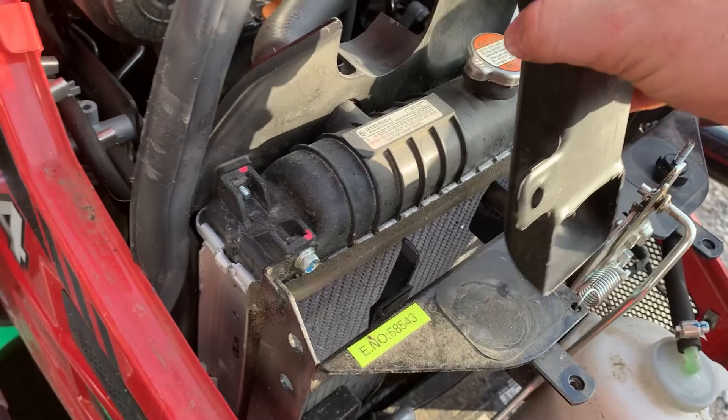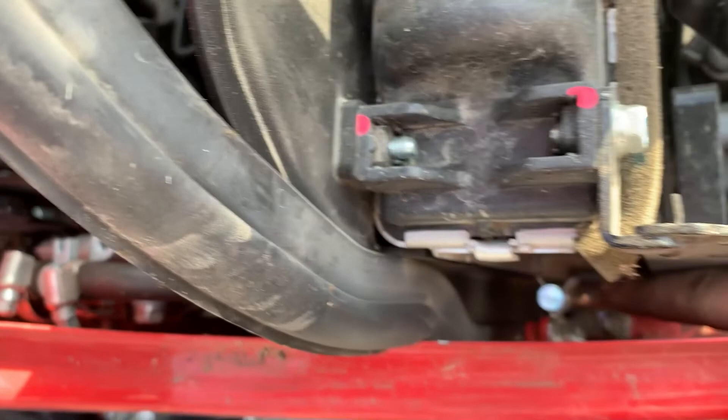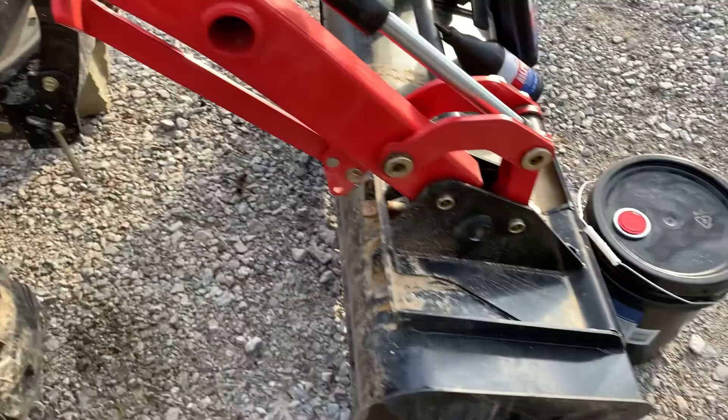Your air filter is in here, but it's hard to get to. Once those side panels and the front end are off — I've got my tire in the way, it's kind of hard to see, but this stuff is really simple. There's just these little clips — here they are. There's just posts and these little clips. Give it a good yank, they're going to pop loose. And there's that seating bolt — you just slide it out. The whole thing lifts out of the way. They make it pretty simple to work on that part of the tractor.